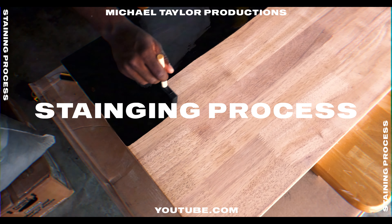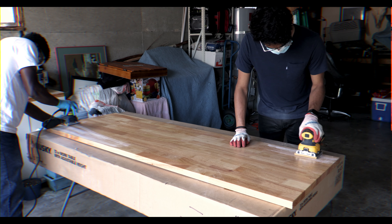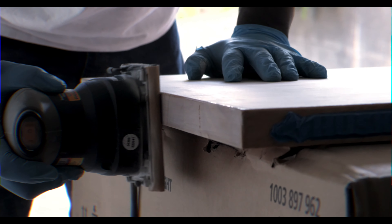Now let's get into the staining process. First, we had to sand off the original coat of the tabletop — this part is super important to get right, and to be honest, we kind of screwed up here. Make sure you sand it all down and get all of the original coating off. We did about three passes: 80 grit on the first pass, 120 grit on the second, and 220 on the third to smooth everything out. Also make sure you get the corners and edges.